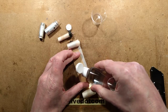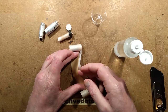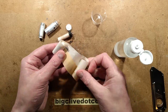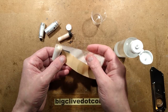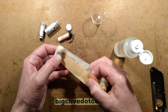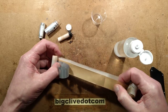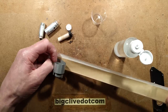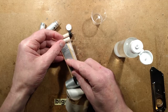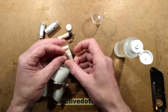This electrolyte is fairly safe — it's not something I'd like to eat. Is that going to soak into that one? I think that's just sitting on top of that one, but it is soaking into this one. So this may be the absorbent separator, and this is just a sort of not terribly absorbent, silicone-sealed or wax-sealed separator. Inside those is two layers of aluminium. Let's just unroll the whole lot. The space top to bottom is just that little bit extra to prevent tracking over the edges of the foil.